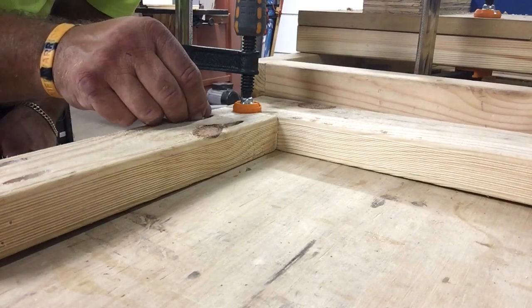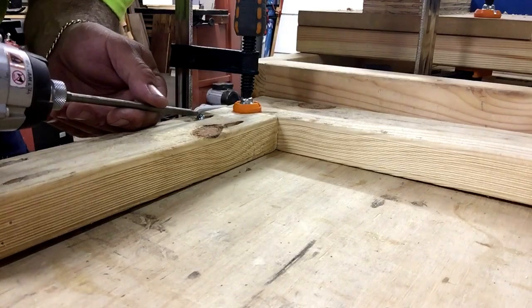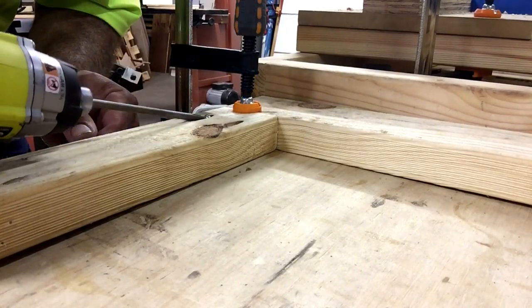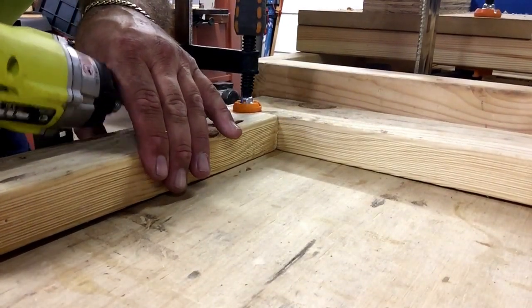You can see here I'm just putting the screw into the pocket hole, getting our impact driver with our bit, and just putting a bit of light pressure on to drive the screw in. You can feel it — it'll take up the slack and lock into place.